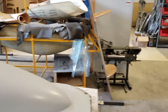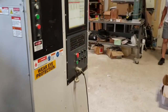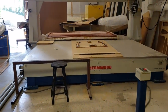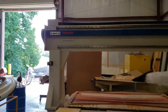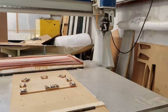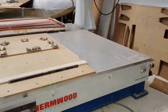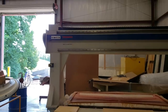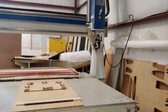If we walk around the corner here, we can show you the big machine that actually takes that CAD image through the use of a generated toolpath and turns that big block of whatever material into the shape you just saw a second ago. This machine is capable of cutting — having a cutting envelope that is approximately 98 inches by 138 inches by roughly 30 inches tall. Within that envelope you can machine any number of shapes. The machine employs five axes, so it can literally reproduce almost any shape imaginable.